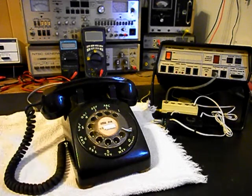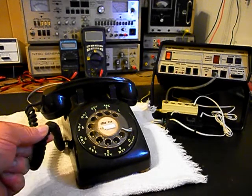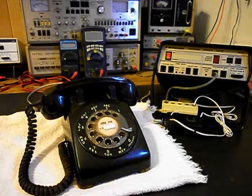We also want to go through the network. We want to make sure that the network is wired properly and that all of our connections are tight. Our handset cord, transmit, and receive will all be troubleshooted. So we're going to go through everything and we also want to troubleshoot the bell and bell circuit issue. We have a lot of work that needs to be done.